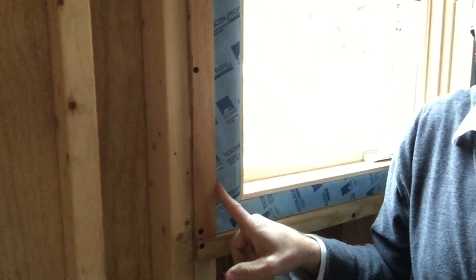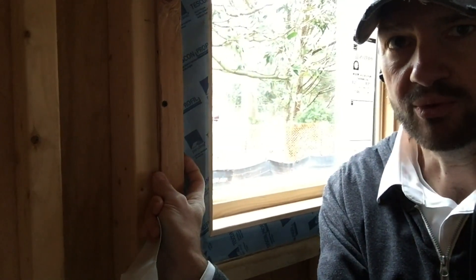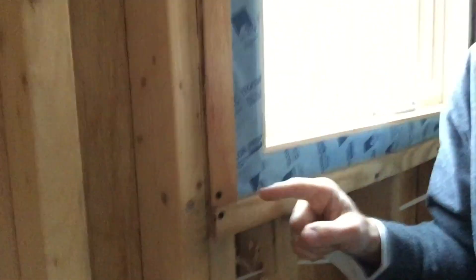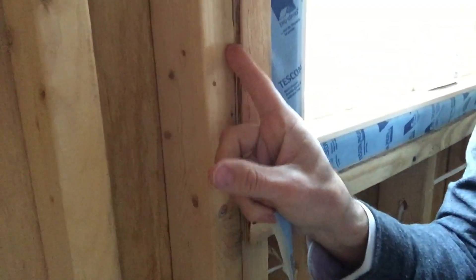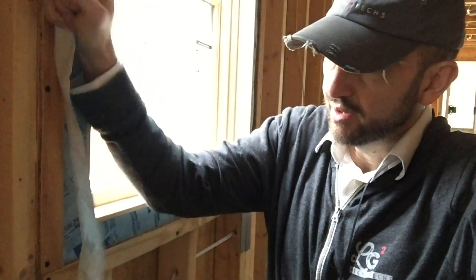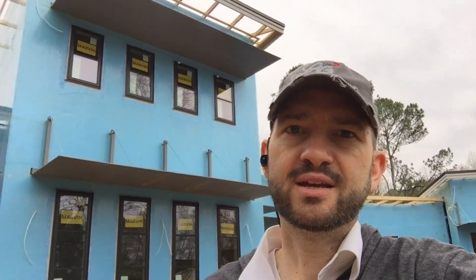we've installed this one-and-a-half-inch-wide strip of plywood that covers the edge of the tape. They can run their drywall right across this plywood, and use it as a guide around the window — just slap that drywall right over the top, find the edge of that plywood, and zip all around the window to get their opening. Thanks for watching this video on interior air sealing of doors and windows. If you haven't already, hit that subscribe button and get our weekly updates.